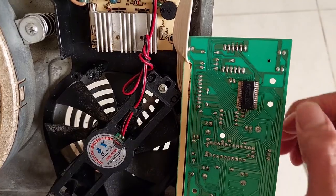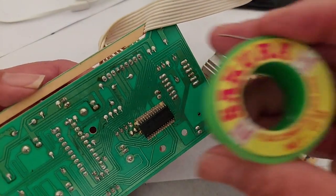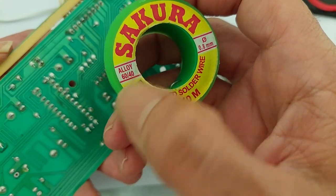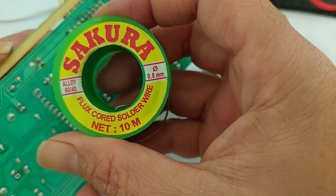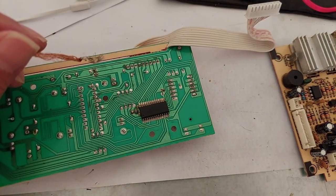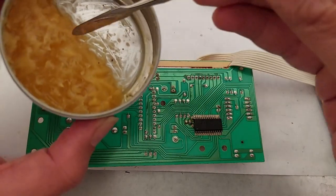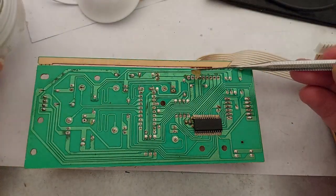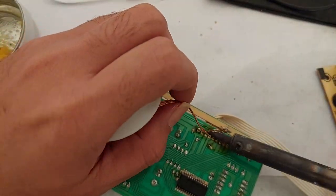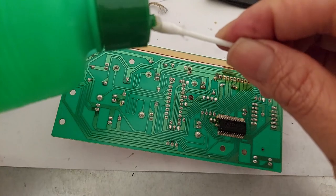You can see from the tin color that is getting gray — that means oxidation is going on. Make sure all the connections are good. For soldering all these legs, you need a good thin solder — I think this one is good: alloy 60/40 composition. I'm using soldering wick and flux paste so it will be easier to clean.